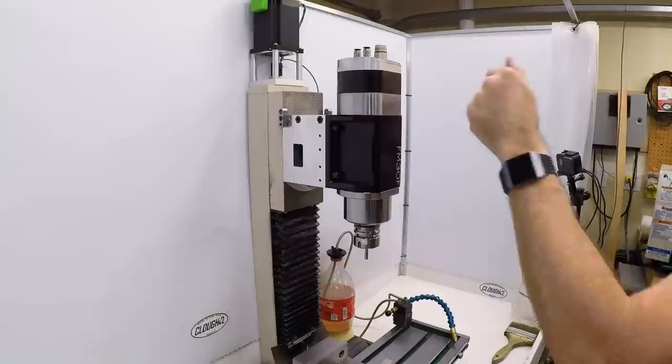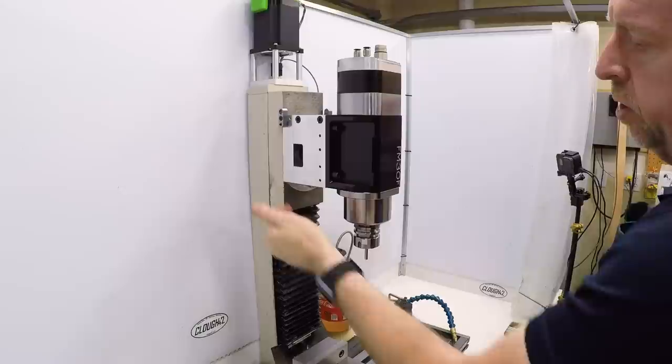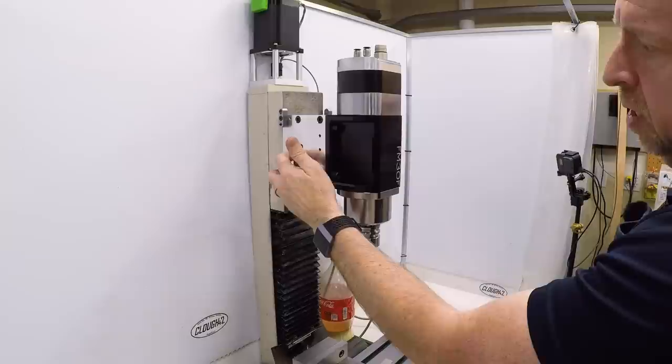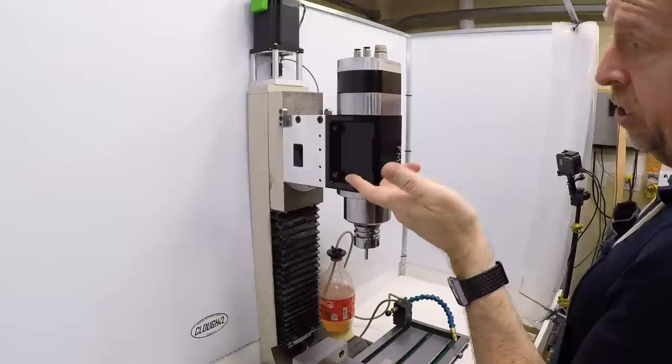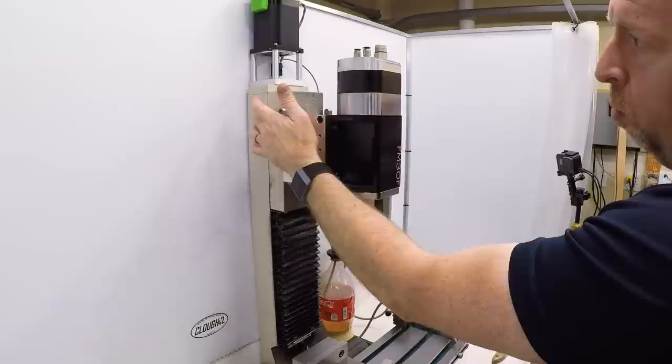We've got the spindle all mounted. I went ahead and took one of the screws out of the tramming bar and turned it vertically so that it no longer engages the back plate. I got some comments on a previous video saying that if I installed these tramming bars, I was actually going to be removing one of the safety features of the mill — which is that this head can actually rotate in a crash and release some of the pressure so I don't damage the spindle bearings. And that actually is not dumb. So I went ahead and did that. I don't need them right now — I'm not tramming. So I took one screw out, rotated it, tightened it back down to vertical position so it won't engage that back plate. In a crash, the spindle actually can move.